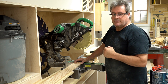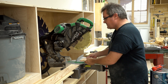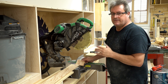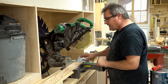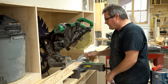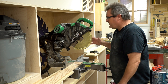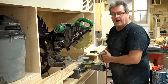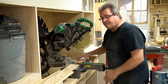You do the five-cut method exactly the same way as on the table saw — make one cut, rotate the board 90 degrees, make another cut, and so on. I'll leave a link to the five-cut method in the description for those interested, but for me this is going to be fine. As far as the other settings on the saw, they should be accurate depending on the quality of your saw. This is a very well made saw and the other detent locations for angles like 22.5 and 45 degrees are very accurately set, so I don't have to mess with anything after making it 90 degrees.